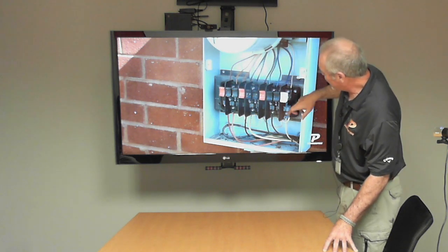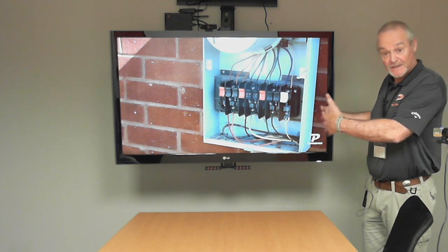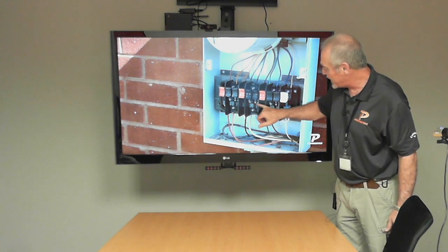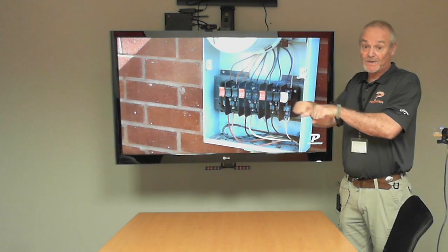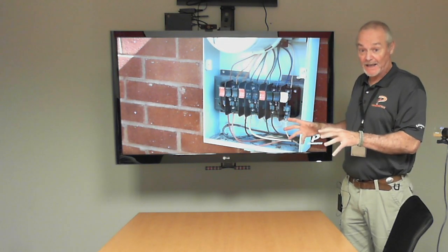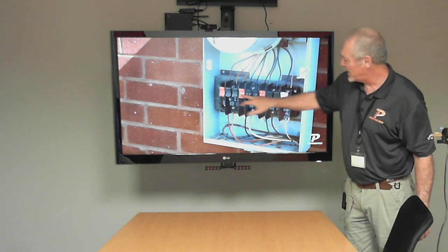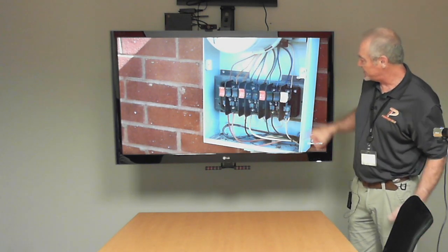So I've got my shunt and return and my voltages laid out. Some of the older test switches — those Southern States ones — will actually flex when you go to pull them open, and I'm watching that when I'm inside that can. This is an older test switch, so we know it's going to be pretty sticky and probably not going to actuate well. We'll shoot it with some lube first. Short stroke, cross bar — that's my shunt. Return is right there beside it. Here are my voltages. Know the layout before you get in there.